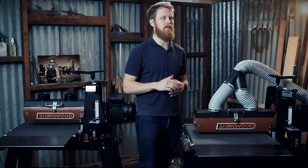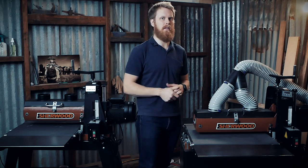An important feature to keep in mind is that, like a belt sander, this chews up material extremely quickly. For that reason, I wouldn't recommend going with any grit lower than 120. If you're looking for a really nice finish surface, go 180 and higher. Even at higher grits, be aware that it will still take material off quickly.